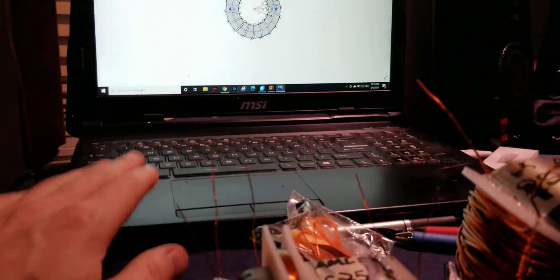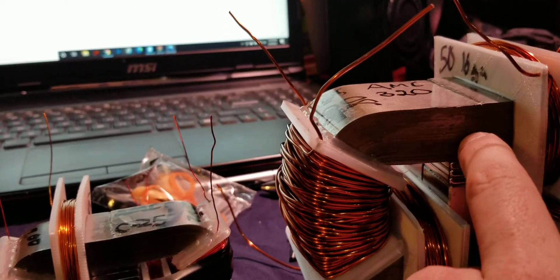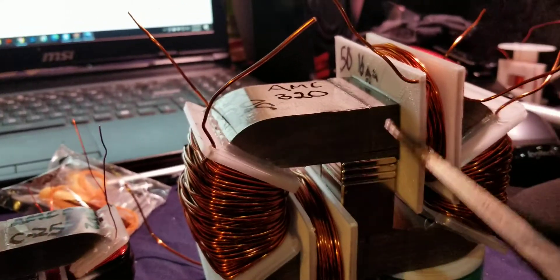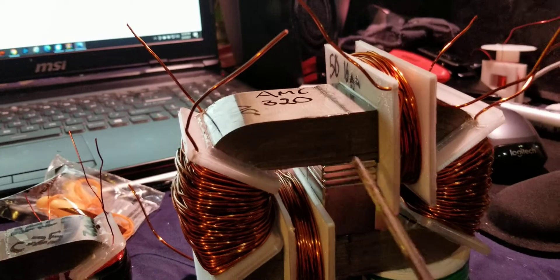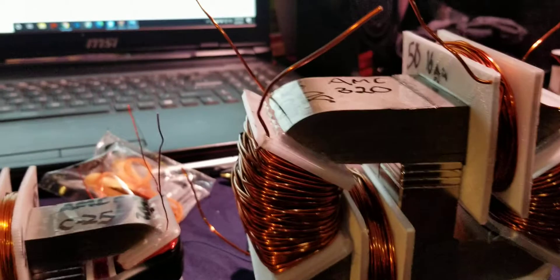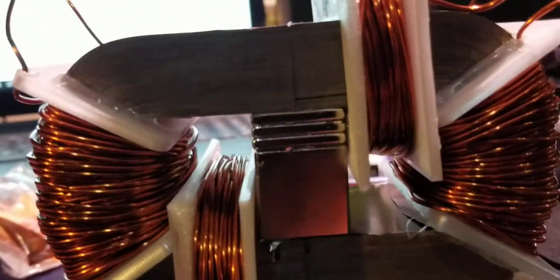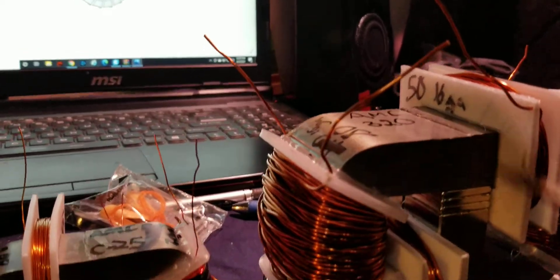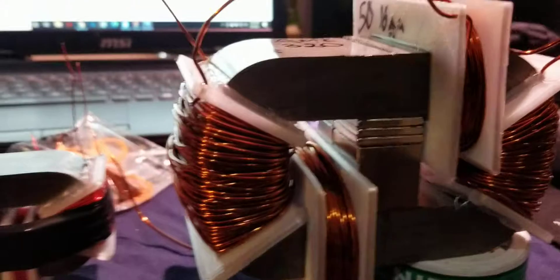I know it's right by my computer — this has solid state drives in it — but we don't have to worry about that, because when there's a magnet inside this core, most of the magnetic flux is stuck and trapped inside that core. You can see there's not a lot of magnetic field here with these scissors. This one's even more so because the magnet is further in there. There's a little air gap — you can't have no air gap — but that little air gap will let some magnetism out. And look, there's not any magnetic field on the top anywhere; it's all trapped in the core inside those little micron layers.